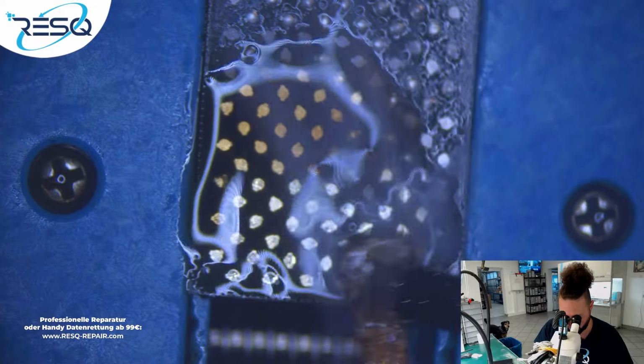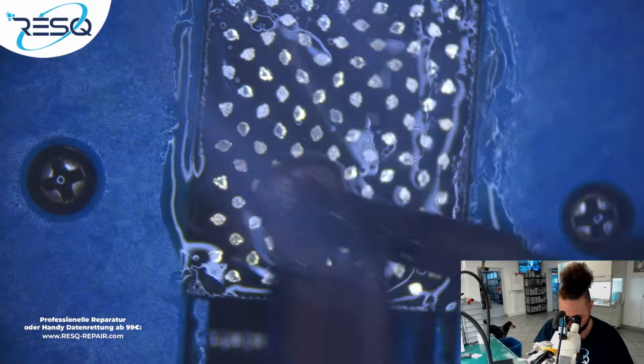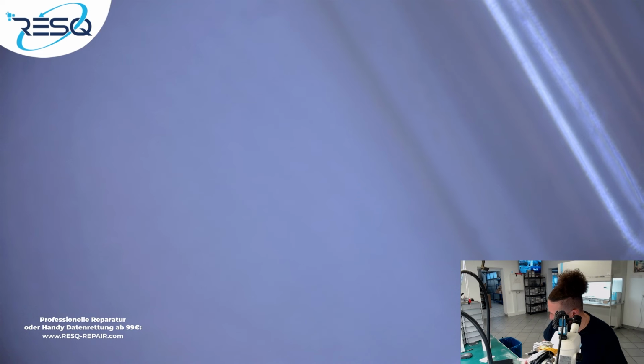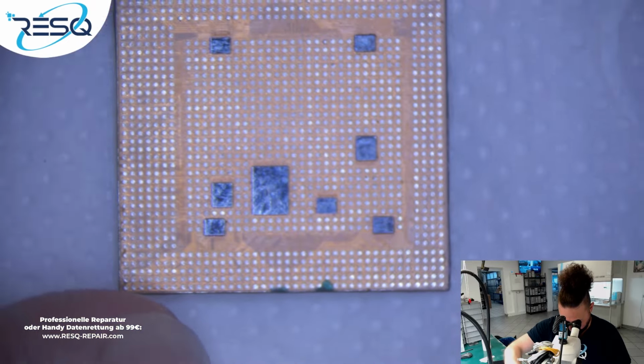So now we just clean up the NAND. Looks better than the CPU. Yeah, but the CPU in general was okay, but normally we don't do damages like that. So we now have to reball these two parts. So I just need to clean up the stencil. I used it yesterday in the evening for swapping the XR. You can see that on social media. So, and now we just have to reball that beauty.